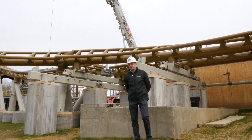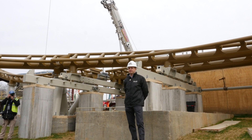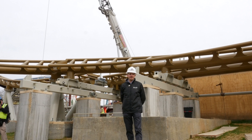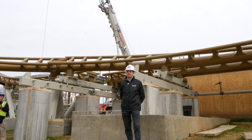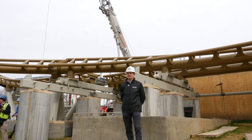We're actually going to be starting commissioning very soon. Part of the beginning of a commissioning process is we go into an electrical I/O checkout — we check all of our cable terminations on the launch system, we check our terminations on the low voltage ride control system. That is typically a two to three week process before you even start moving trains or anything like that.